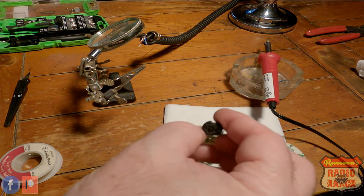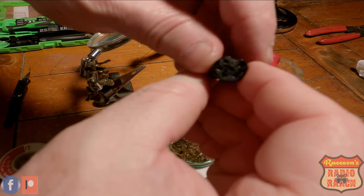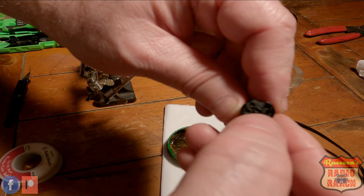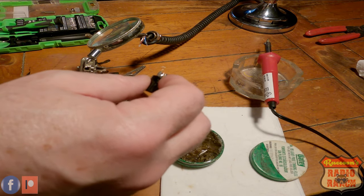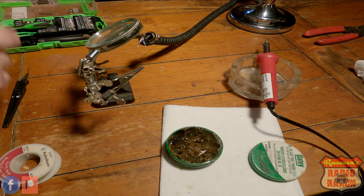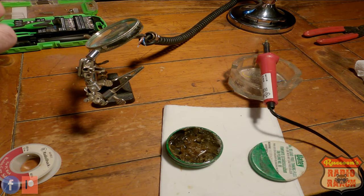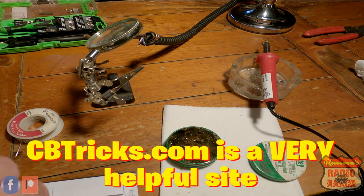Then we take our mic jack. If you look at these mic jacks, you'll see, I don't know if you can see them on the camera or not, but it marks them pin 1, pin 2, pin 3, 4, 5, and 6 is in the middle. And it says it on the back side too. You're going to want to go online and look up the wiring code for that specific radio that you're wiring your mic to. I can leave a link in the description below that will take you to where you can download a wiring book so you'll know what your wiring codes are. Or you can look on cbtricks.com.